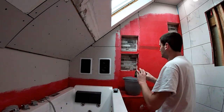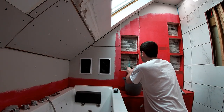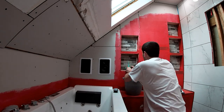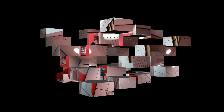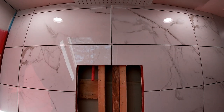Once you have these things in place, use a level or a laser level to make sure you're nice and straight, because there are really no reference points yet in terms of outer tile to bounce off of. Now that I have my first wall completely tiled...